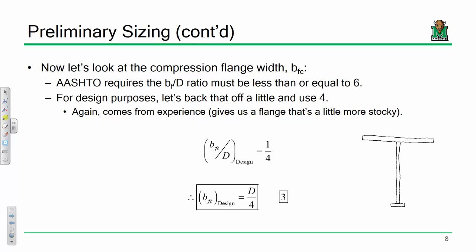Is that an I-beam? You're saying, yeah. Is it going to behave like an I-beam? I would argue that that's going to behave much more like a T-shape than an I-beam. Okay? Is it horizontal plates that are parallel welded to a longer longitudinal plate? Yes. But I would argue it does not meet the cross-section proportion.